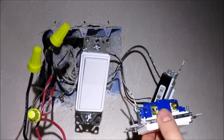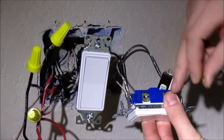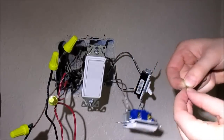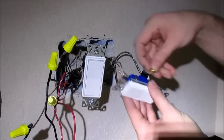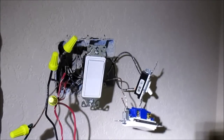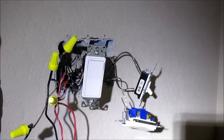This particular light switch also comes with a little plate. When you run the wiring through the plate it'll cinch it down after you put the screw in. You run the wiring below the plate, run the plate over it — it has a little notch that comes out so you have to match it with the hole. After the wiring is under there, put the screw back through and cinch it over the wiring. It has two little slots where the ends of the wires can run through; however my wire is a little bit thicker so I haven't been able to use those slots, so I'm not using the cinch device.